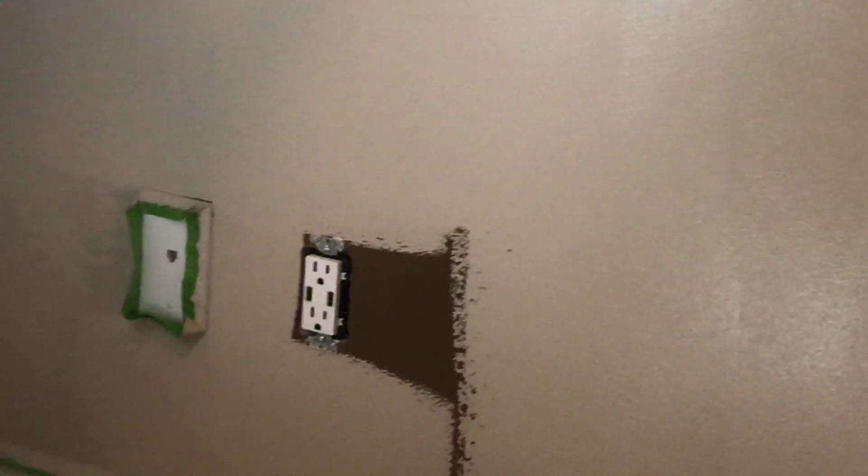So you want to get that tape, get this tape, because I forgot to cut it. Tight roll, close roll to everything. Okay, you need more paint. More paint. Okay. Here. Work your way back. See if I can roll on this side here so you can catch more in the camera. Just even your paint out. You don't want heavy texture.